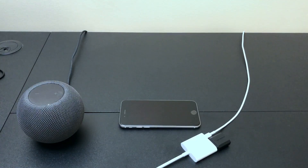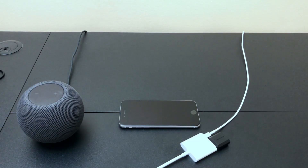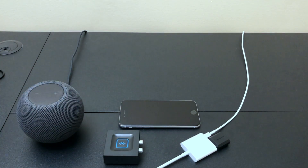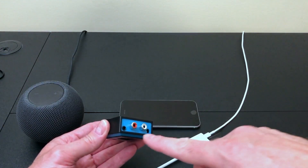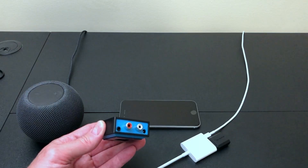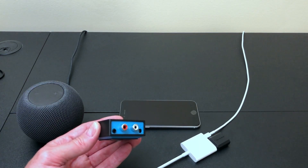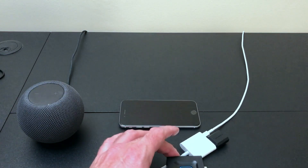The next thing you're going to need to get is a Bluetooth receiver. They are all over the place, from $9 to $99. I wanted to keep this somewhat economical but didn't want to buy the cheapest thing either, so I wound up with this one, which was $22. It has RCA out, 3.5-millimeter line-out, and it comes with two power cables — one for a USB brick and the other a normal AC wall adapter. So you have a lot of choices for $22.